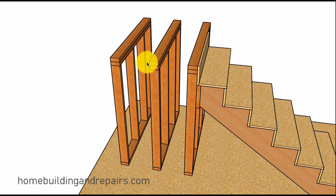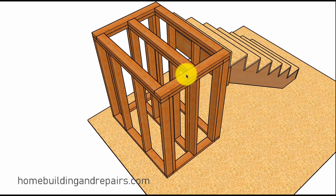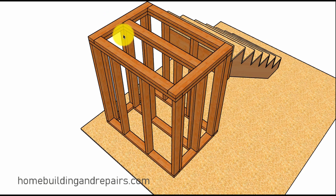Here's another method that might work — a wall in the middle and a couple of walls on the outside. The only thing with this is you're going to need to center the stud so that you can nail the wall framing in the center to the stud. You could always have the plates overlap too.